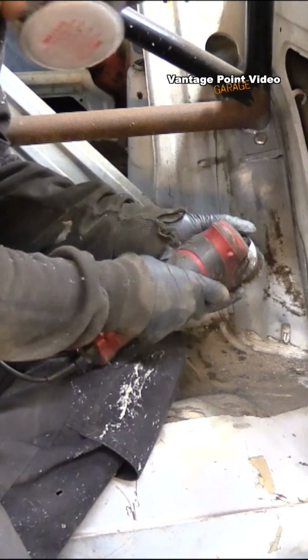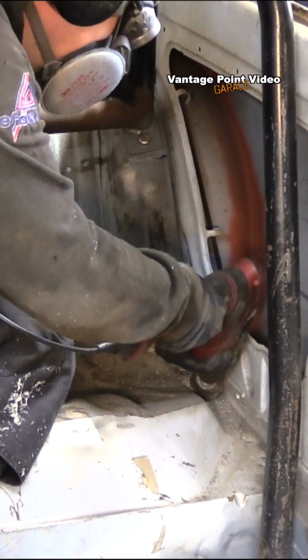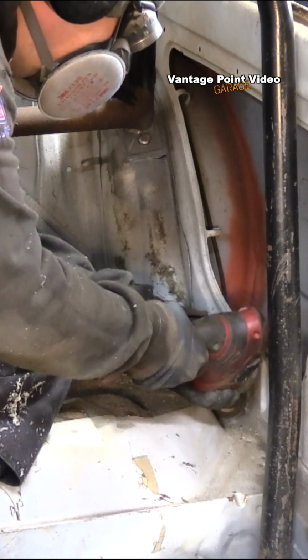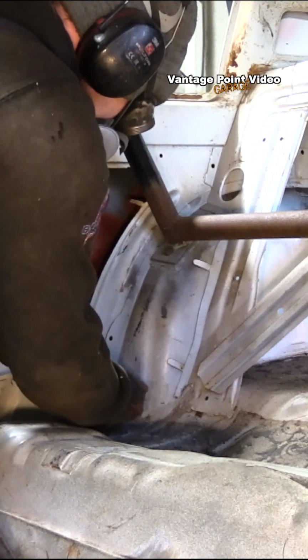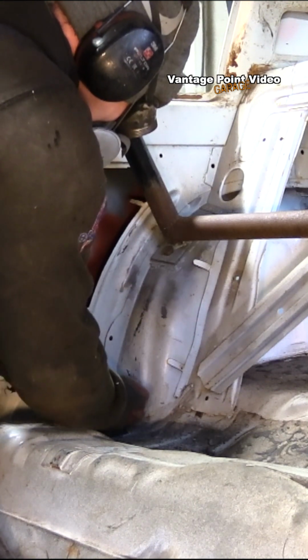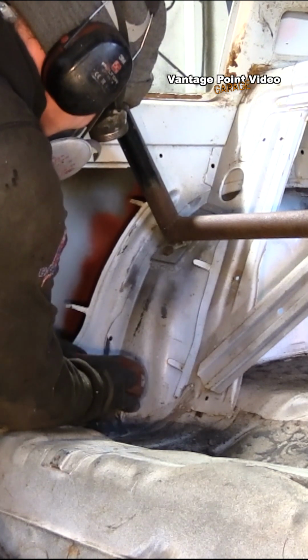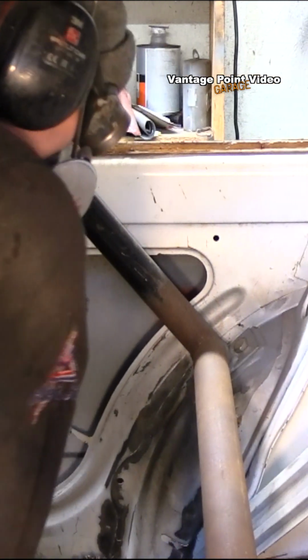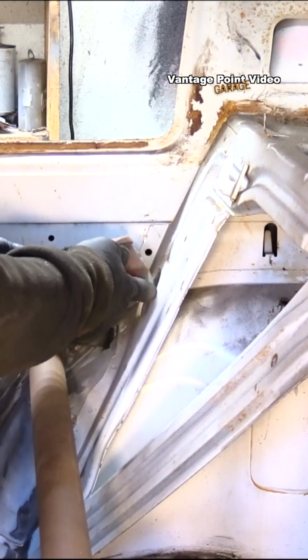There's a little bit less sealant in all this, but that ridge which is underneath the back seat is over the fuel tank, which is not there, I have that removed. It makes it a bit awkward for the grinder to get in, so I use the drill with a little wire wheel on that. Back to the grinder there, and a little bit to the top.